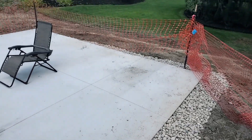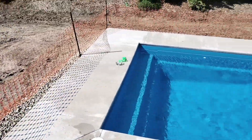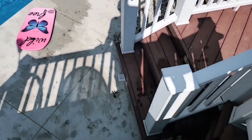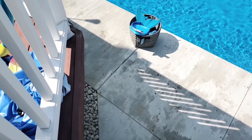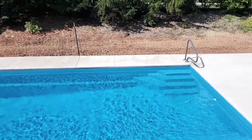One thing I can guarantee you: if you don't use fabric and if you don't use a separate pipe for your roof runoff system, you're going to have a short-lived french drain system. If you want a french drain to last forever, use the fabric so it keeps filtering out all that debris, and isolate your systems — do not share your french drain pipe with your roof runoff system.